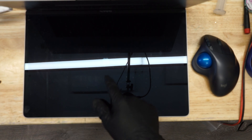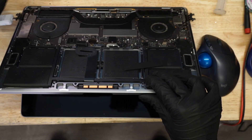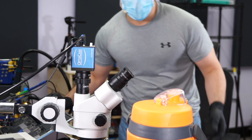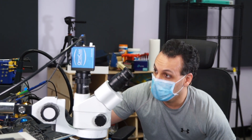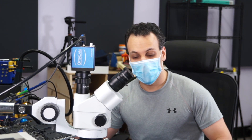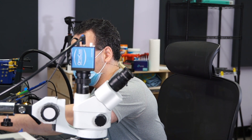Look — there's an Apple logo. It's starting! So that's about it — it's charging. All we did is we reflowed the chip responsible for charging. We're going to ultrasonic clean the board and that should be it. Unfortunately I have to attend to a very unpleasant business matter, so I will be on later. I'll see you all in the next video.